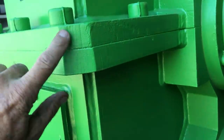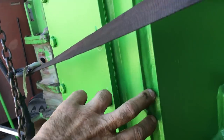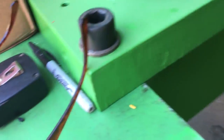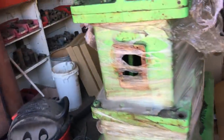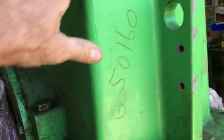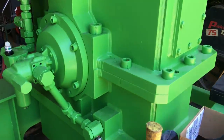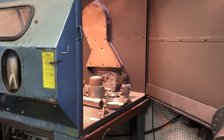I was just showing these because I wanted to point out these are a weldment-style gearbox. A weldment means these are just flame-cut sheet steel all welded together, whereas the gearboxes that I build are cast iron gearbox housings. You can see the flame cut there — whatever thickness material they need, they just cut it out and weld it up. The weldments are way stronger than the cast iron, not that they need it in this application, but the weldments are definitely a much stronger unit.